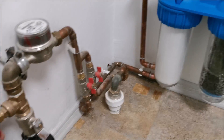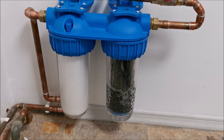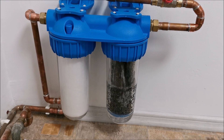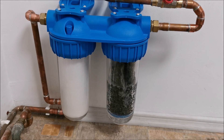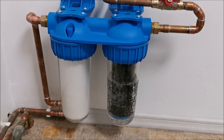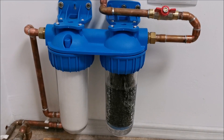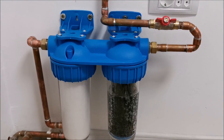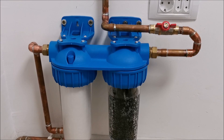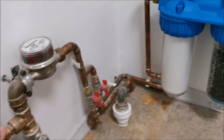Let's give it a bit more flow to fill up. It might not have anywhere to push the air because I don't think there are any faucets open in the rest of the house, so it's just filling and pressurizing the pipes now.